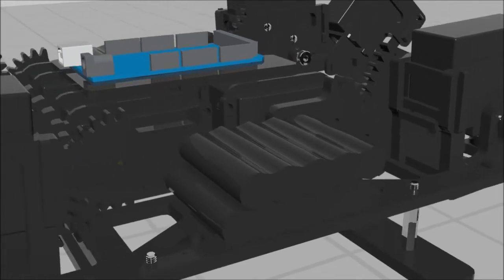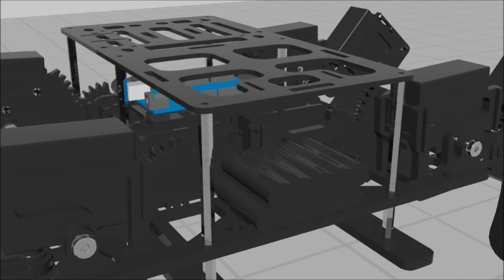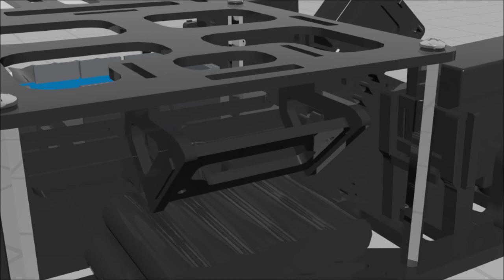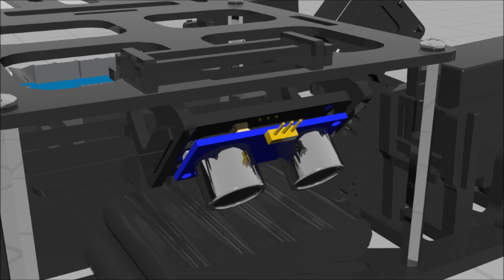Make sure the batteries are near the edge of the frame so they do not interfere with the gears. Select the six female-female aluminum standoffs and screw them onto the threads protruding from the male-female standoffs in the frame. Place the top frame so the six perimeter holes — one on each corner and one on the edges near the middle — are aligned with the threaded standoffs. The side-by-side large circular holes should be at the back of the robot, as shown. Install 8-32 screws into each standoff-aligned hole to fasten the top frame. Align the ultrasonic plates with the two parallel slots at the front of the top frame. Insert the ultrasonic front plate between the ultrasonic plates so the holes are positioned as shown. Slide the ultrasonic plates into the slots, then slide the ultrasonic tab into the slots above the frame. Place the ultrasonic sensor aligned with the plate holes and fasten the sensor with 2-56 screws and lock nuts.